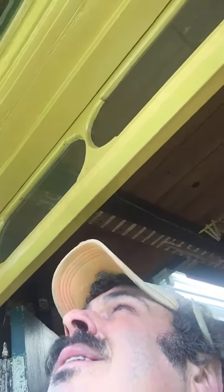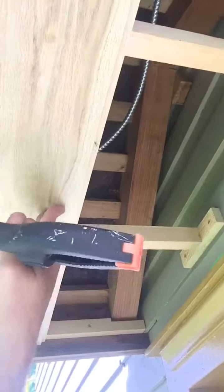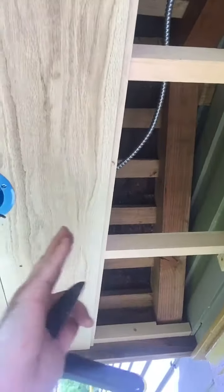I have two more pieces left to put up here. You can see I've been putting them on with clamps until I get them screwed. I'm trying to use a minimal amount of screws — the reason I have the gaps up there is to allow it to move a little bit. There are no screws on this side; the next piece is going to be screwed and hold that tight against the top so it never sags down, but it'll all allow this to expand and contract in the changing weather of an outside environment.